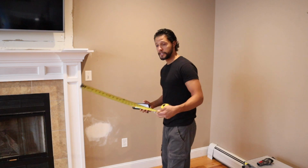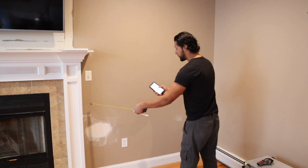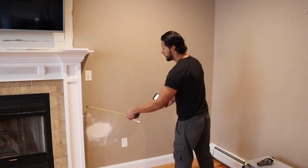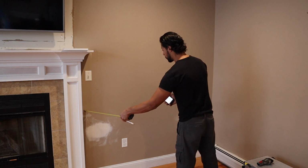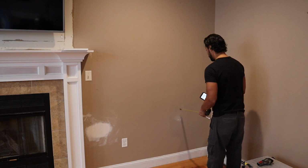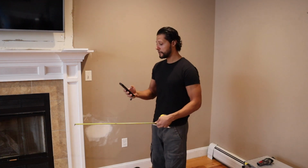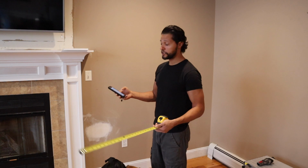So the way we want to do it is, you're going to have 3 boxes. We need to find the width of each box to make it spaced evenly. So if we are doing 3 boxes, we're going to have a space here, which is 1, a space here between the first and second, that'll be 2, and then 3 and 4. So you have 4 spaces. So 4 spaces, and that's going to be 3 inches a piece, so you know that's 12 inches.